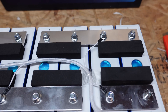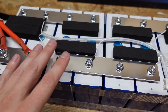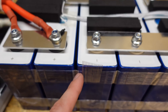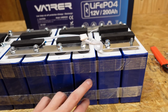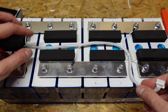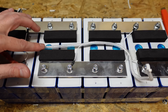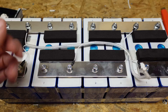I am very impressed at how well this thing is built. These bus bars are huge — they look to be aluminum and just look at how it's attached, it's done perfectly. The cells have what appears to be neoprene foam insulating between them. They are wrapped with two wrappings of strapping tape. The balancing leads are wrapped in spiral wrap and nicely routed down the center of the battery. There's foam at the top and bottom to hold wires in place, with a nice channel for the wires to flow through and to prevent blocking of the vents.